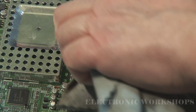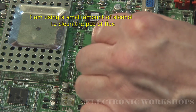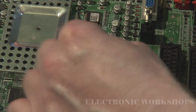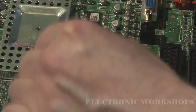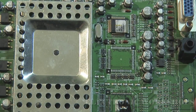When it's still hot I get a cloth, because it's easier to remove the flux when it's still warm. Then I remove any remaining flux with a cotton bud. You can also use a small brush to push away the excess flux — make sure you get all the flux off, you don't want to corrode the PCB. That is the pads cleaned up. There are a few pads that still need a little bit more tidying up, but you get the gist. Hope that's of some help to people who had these questions, and thanks for watching.